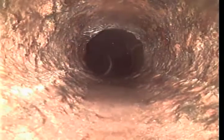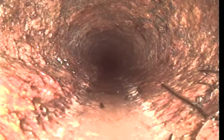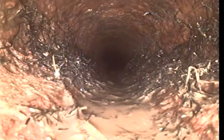We're at the cast iron clay right now. That looks like a possible crack, maybe a root. A slight cause for concern is that it appears the cast iron has started to let in roots. The quality of the cast iron does not look very high — it looks somewhat rotten. Here are the roots we're talking about.